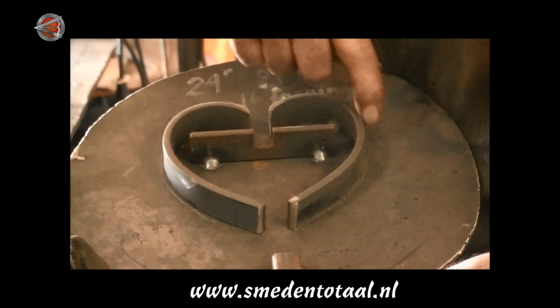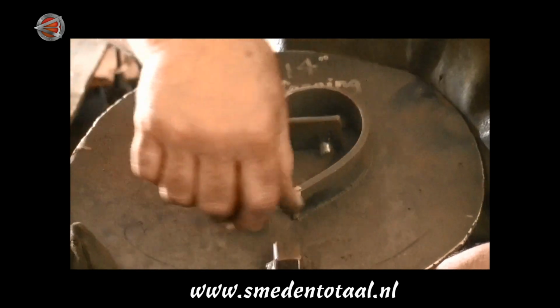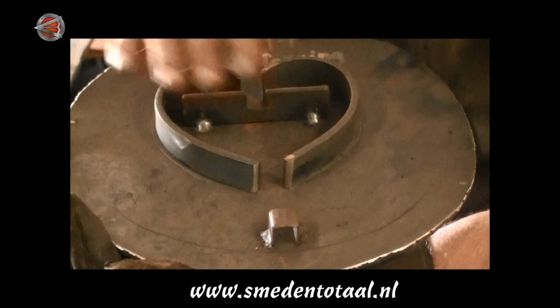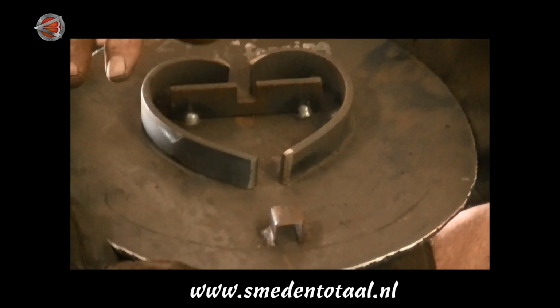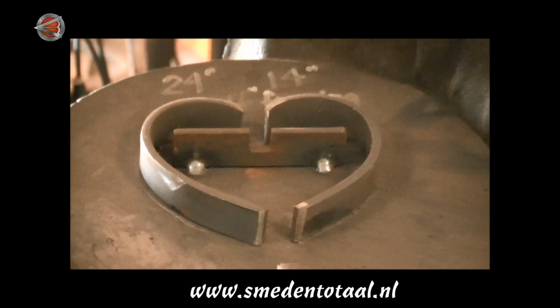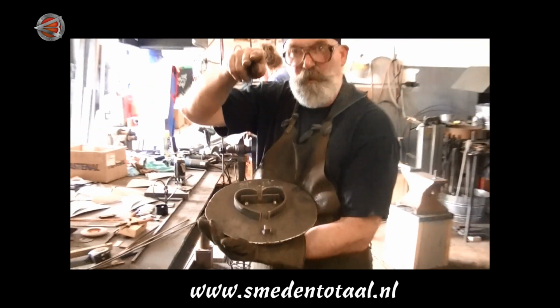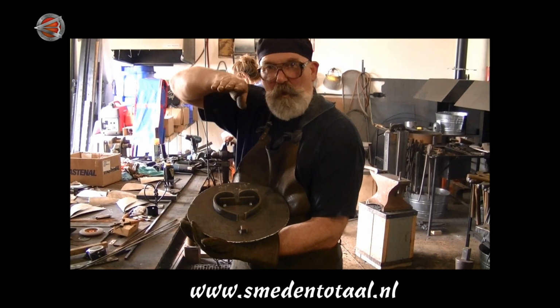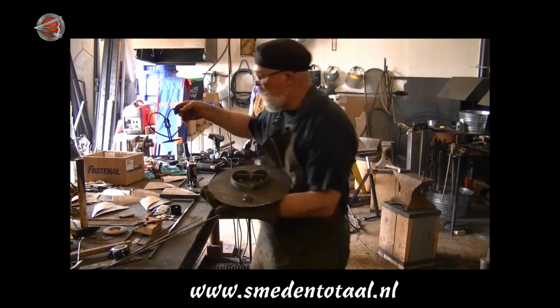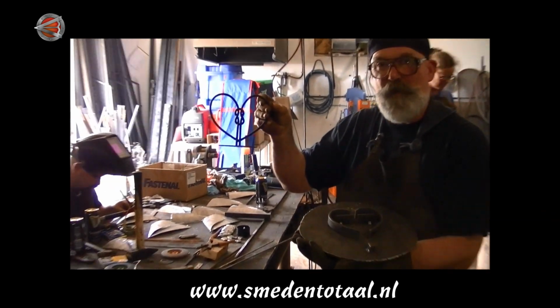The 2 long pieces come out this way, and we bend them around together. At a certain point, you get balanced. I usually produce them like this because we do lots of them. And then I throw them out, and when they're cold, I take a kink tool, which is a tube with 2 pins on it, and I form that to try and get the 2 sides of the knot to come out in the same shape.